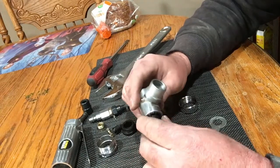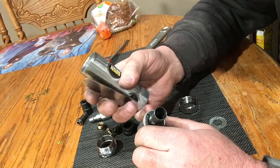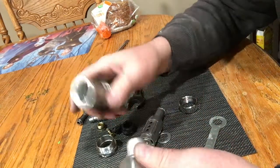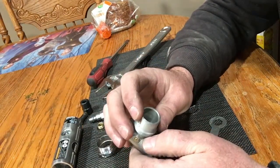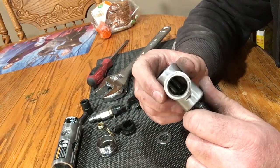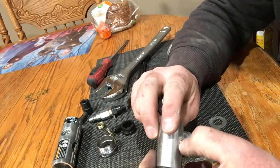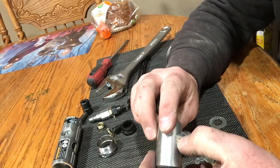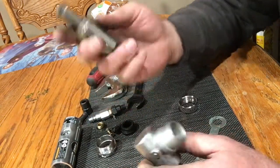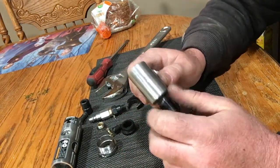One of the things you need to check if the air is going through it and it's turning but nothing's happening up here — you need to check where these two gears meet up. You can't really see it in there. Right up here there's a gear and there's a little bit of lubrication. This here is a grease nub, but to be honest with you, just take it apart, dip it in some bearing grease and put it back on there. That fits up in there against that and those two turn.